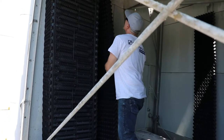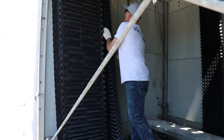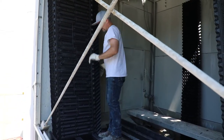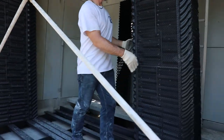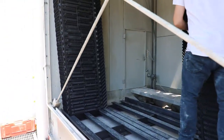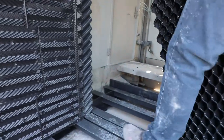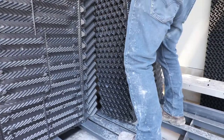Now add the rest of the fill packs in the row. In our case, this is a CF-1900 stuffer pack and an integrated drift pack to make sure everything fits nicely. Here we also had to trim the back of the fill supports to make sure we could remove the strainer basket for cleaning. Go around making sure the fill supports are positioned square in the tower and check shims and levelness one last time.